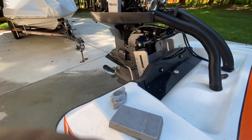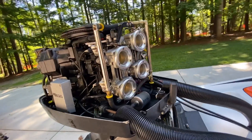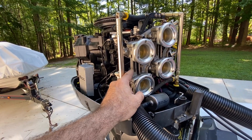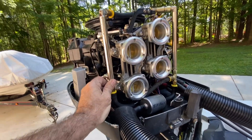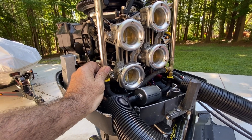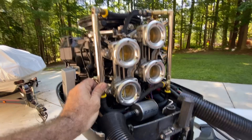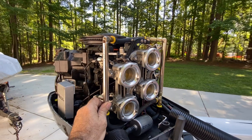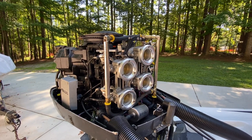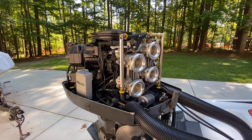We sold quite a few of those. Now, the reason this fuel injection conversion increases power or speed: these are the throttle plates that go behind the carburetor bodies on the stock motor. The throttle bores are one and seven-eighths inch, but on the carburetors themselves, the venturi size is about one and five-sixteenths. So it's a big increase in area. On a V6 boat like this, you'd see about a four miles per hour gain in top speed — that equates to 15-plus horsepower.